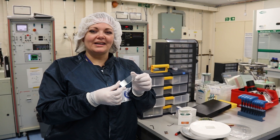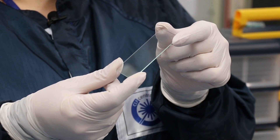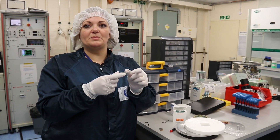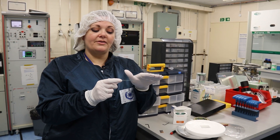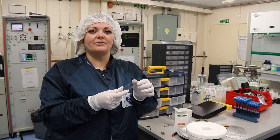The first step of thin film targets is to coat glass microscope slides with some salt. Once we've coated the salt, we then transfer these slides into one of our other coating plants to coat a thin layer of aluminium, gold, silver, copper, or whatever material has been requested.